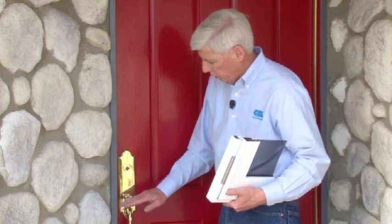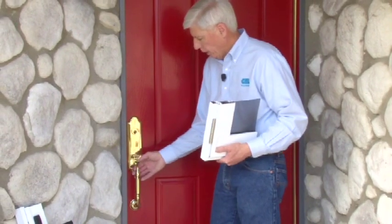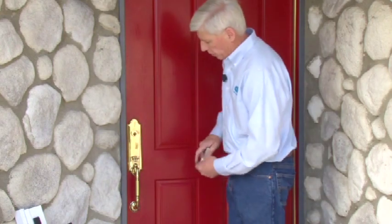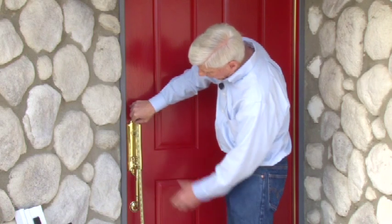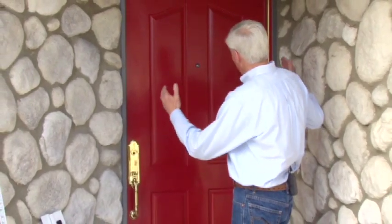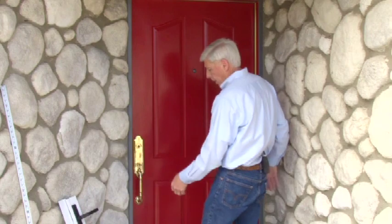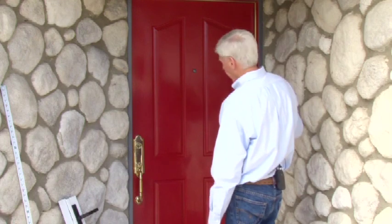You take the highest measurement of your door handle. In this case here, it just happens to be the thumb button on the door handle that is the tallest point of this door. So we want to measure from the bottom to that thumb turn, or the thumb knob there. And then we're going to add 4 inches, because we want to move our handle hardware up away from that thumb latch. And we're going to measure it using the shortest dimension in this opening. So I'm going to start with the width in three places, at the top, middle, and the bottom. We're going to do our height that we want our door to be. And we're going to start on the left, and the middle, and the right.